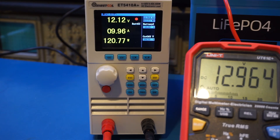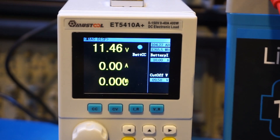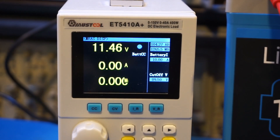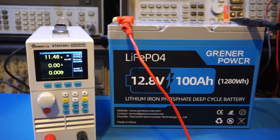This shouldn't significantly affect the capacity measurement accuracy — from 10.3 volts to 9.5 volts would probably take just an additional minute. After the cutoff, the battery voltage recovered and hovered just under 11.5 volts, which corresponds to 0% state of charge. We were able to get more than 104 amp-hours out of the battery, which exceeds the specified 100 amp-hour capacity. This measured capacity is actually higher than a couple of other 100 amp-hour LFP batteries I recently tested.